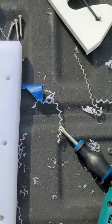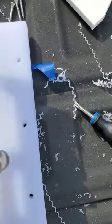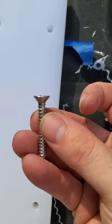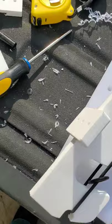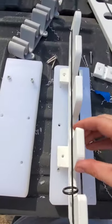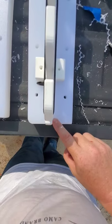So the way I set mine up is I've got my piece of cutting board slash starboard here. When I cut the starboard I cut it into four 4-inch widths, then put my original Atwood holder on here as a template, got it centered, drilled my holes, and then used a countersink so my mounting screws mount flush. These little mounts come separate so you can move them up and down. I got it to where the bottom is lined up with the bottom of the puck — looking straight up and down, it's lined up.